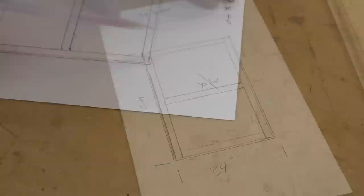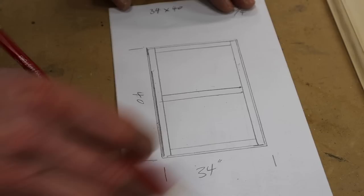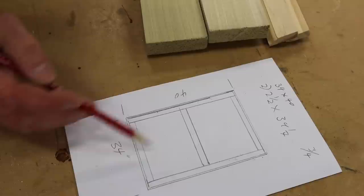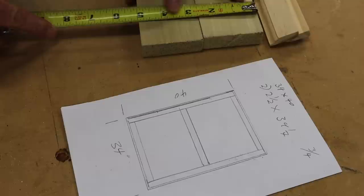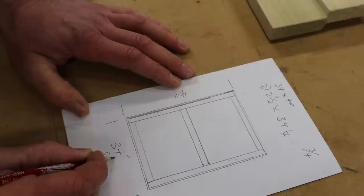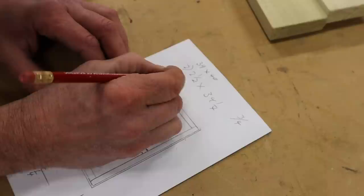So this is three-quarters of an inch. For the two long parts of the frame I'll subtract three-quarters of an inch, which will leave me with 39 and one-quarter. For my cut list I'll write down: quantity two, two and a half inches by 39 and one-fourth. To find the measurement of the shorter parts, we know the 1x3's measure two and a half inches, so that's five inches, plus the edge banding — the doorstop — doubled, which is five and three-quarters. 34 minus five and three-quarters is 28 and one-fourth. So we now need: quantity three, two and a half by 28 and one-fourth.